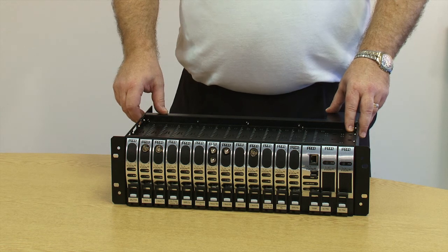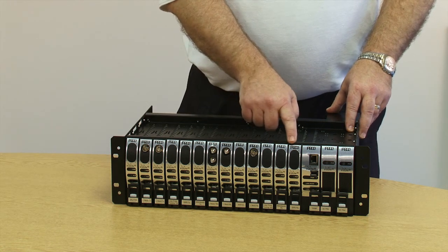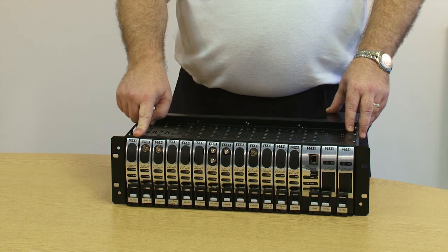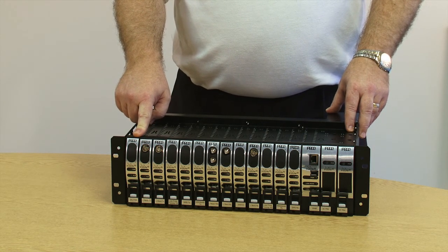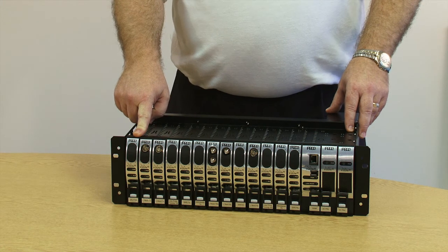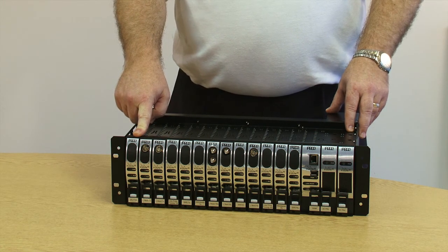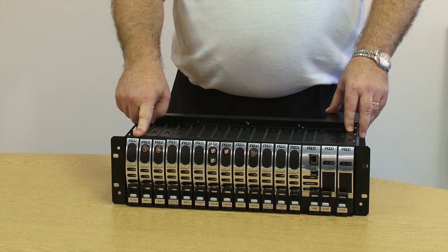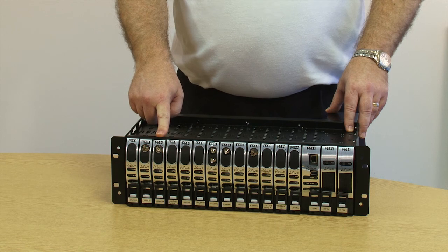The rack itself has 15 slots. 13 of the slots carry general purpose modules. These can either be single or dual RF over fibre modules, allowing us to support up to 26 links. There are a wide range of support modules also available which include amplifiers, splitters, switches, serial digital and ethernet media converters.